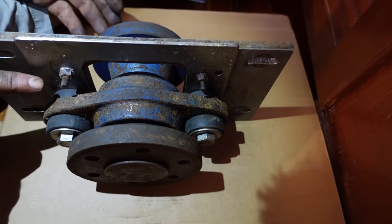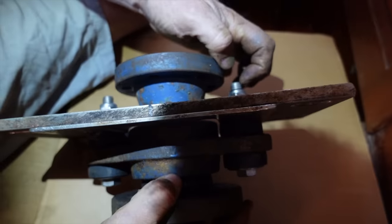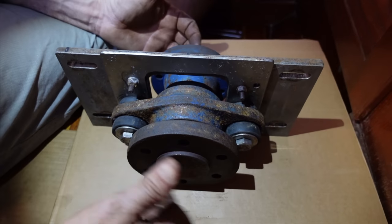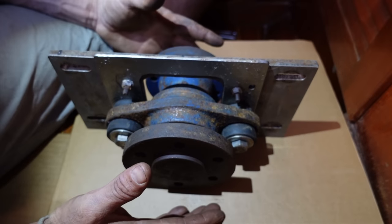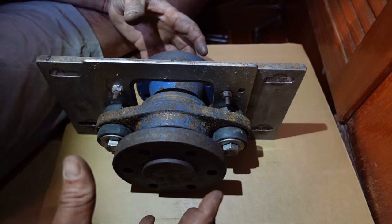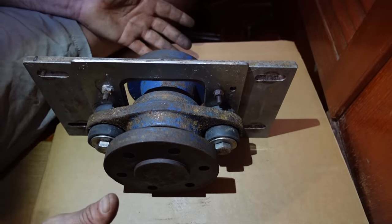I've just taken a few measurements. I've measured the internal bit of the rubber here because I want to put it back together how I found it. I've measured the end of the threads so I know how tight to do it back up. I'm obviously filming this for you guys, but at the same time this is a video reference for me. When you pull something apart, generally you want to put it back exactly how you found it. I've put some marks on here — reference points — so the actual whole drive chain goes back together as I pulled it apart.